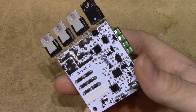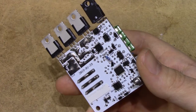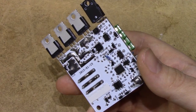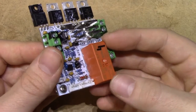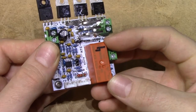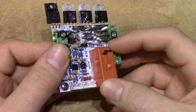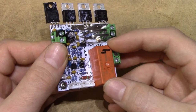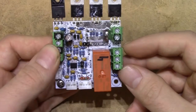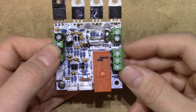So you can just plant this big heatsink box out in the field if you want to test a remote battery, leave it running, go somewhere else, and read the data out when you get back. One of the prime features is also the large orange relay, which is intended to connect to an external charger, so that once the unit has run a load test on a battery, it'll change the state of the relay and connect the charger to the system, allowing you to essentially let this unit run completely standalone with no human intervention.